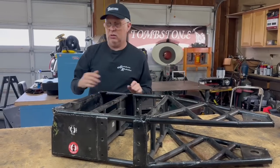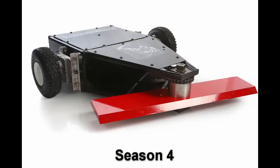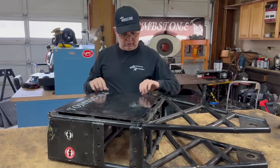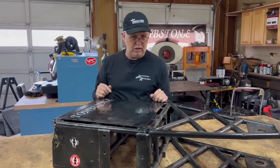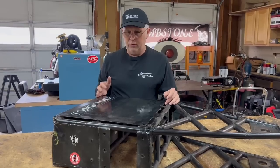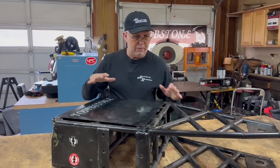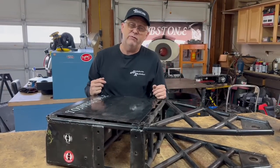In this season we went from basically the stone look on the armor panels to an all-black look — all black all the way over. Still a similar design with relatively thin titanium all around: still 90 thousandths here and I think still 63 thousandths on the front. I don't have any of the other panels because I've sold them all through eBay — I'll probably list this one too. But this is the basic configuration of how the robot was run for Seasons 4 and 5.